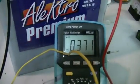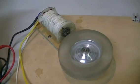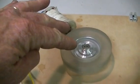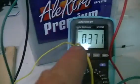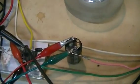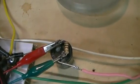12 volts at 371 milliamps input, which is running the system. The system is going to run regardless of whether the rotor is there or not. What we want to do is an on-the-fly test where we allow the rotor to spin and see how much our input power is and how much our output from our flyback is. 7.04 volts across 100 ohms gives us our power being dissipated across that resistor.